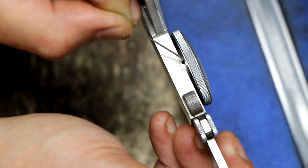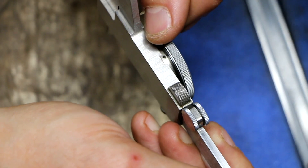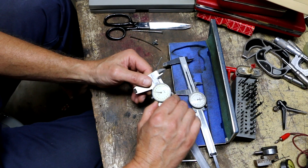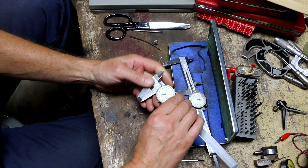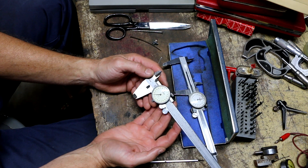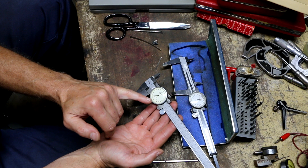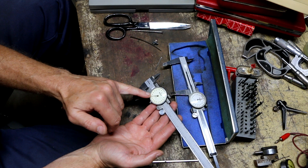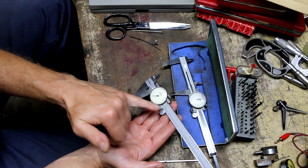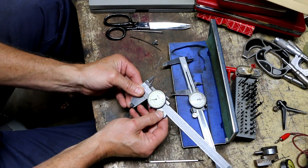This one has almost a little springiness to it — you pull up on it and you can see the hole. The first thing you need to check is make sure that they repeat. These also need to be clocked, but you can see I can go over and over again and the needle always comes back to the same spot. That's repeatability, and you've got to have that before you even bother reclocking, because if you don't have it, it means the pinion gear is jumping on the rack. That could be a damaged tooth on the pinion or rack, but oftentimes it's just debris — a little piece of swarf — and cleaning out the rack will solve the problem.